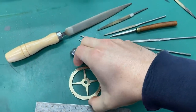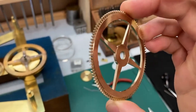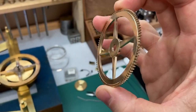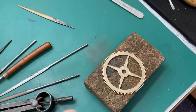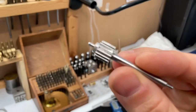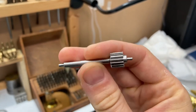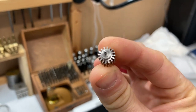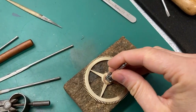Here's the completed wheel — crossed out with 100 teeth cut — and that will shortly be fitted to the corresponding pinion. This is a pinion that I've just made. The machining is all complete but I just need to harden it, then temper it, and then polish it up, ready to fit to the wheel.